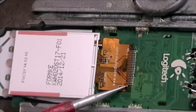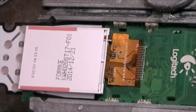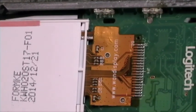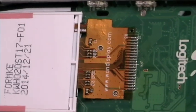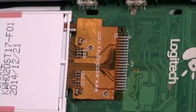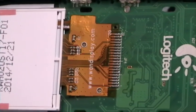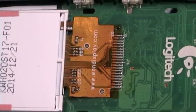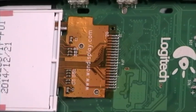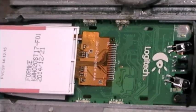That's beautiful work. Your solder leads and solder work should look very similar to this. If you see lifted pads, burned pads, or incomplete joints, you used a tip that was too narrow, used too much heat, dwelled on the leads too long, or didn't use enough flux. So this is what it's supposed to look like — inspect carefully.